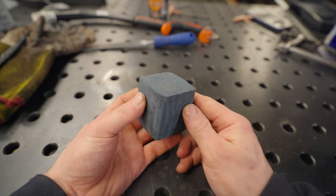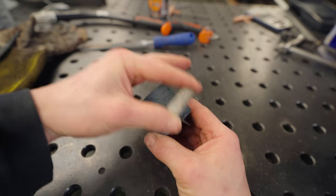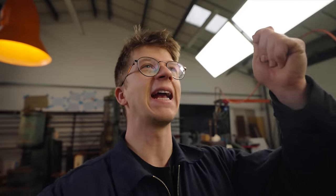Here is what our bit of Damascus steel is looking like right now. I have forge welded those bits into a block. It's this lovely pattern repeated up, up, up, but I noticed some cracks as I was welding this together — see the remnants of one there. And so before any of them get any worse, considering I'm going to be hanging perilously off this tool, I want to see if I can grind out the cracks now at this point.